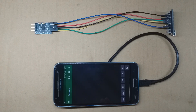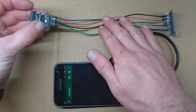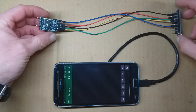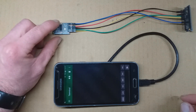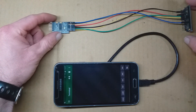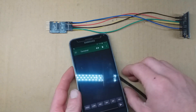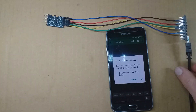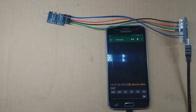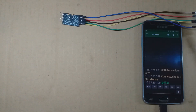I'm actually going to use a smartphone rather than screen capture on the laptop, so you know I'm not faking anything — you can actually see the Arduino. A quick warning: if you're going to connect the rate pin to a microcontroller, make sure the solder jumper is not grounded, otherwise you will over-current the microcontroller pin. A future update would be to add a 1k resistor in series there for protection. The Arduino is running my test code, which I'll leave in the description. It outputs to the serial monitor every 10 samples to slow it down so you have a chance of reading it.